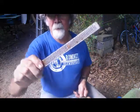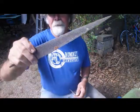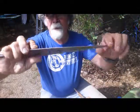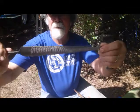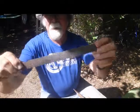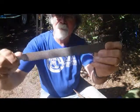Next comes the fun part of sitting down with a rasp and rasping away — that might take about an hour. I usually use three different rasps, starting with a Nicholson coarse rasp. Then I move on to a dragon rasp from Stuart McDonald — a little pricey, but these are nice hand-cut dragon rasps. And I finish off before sanding with a super sheer from Nicholson, which gives a nice smooth finish.